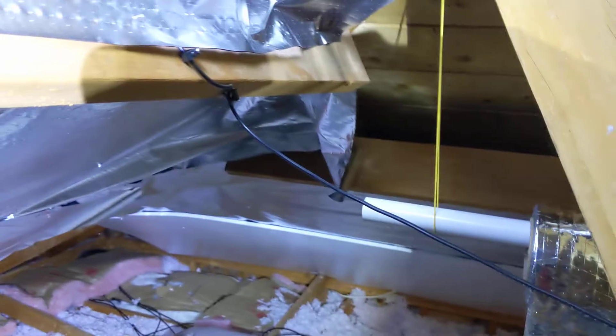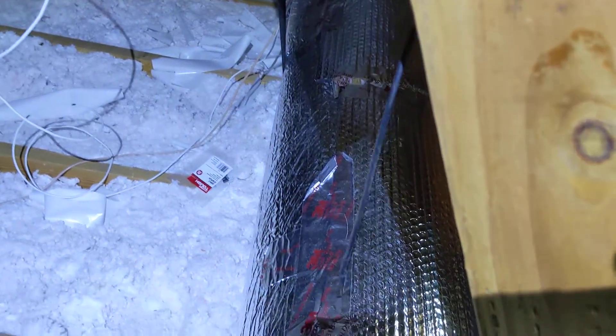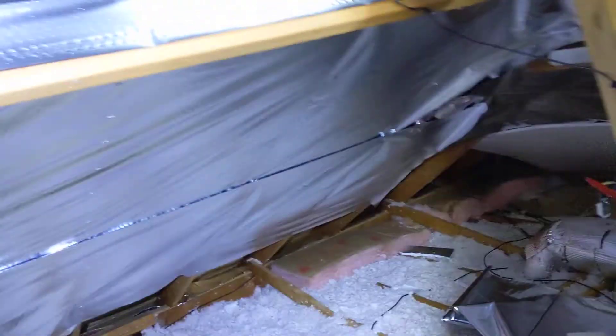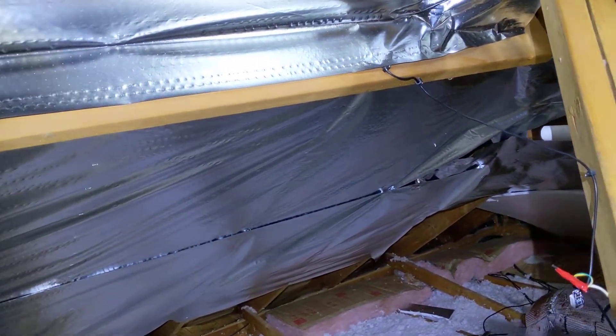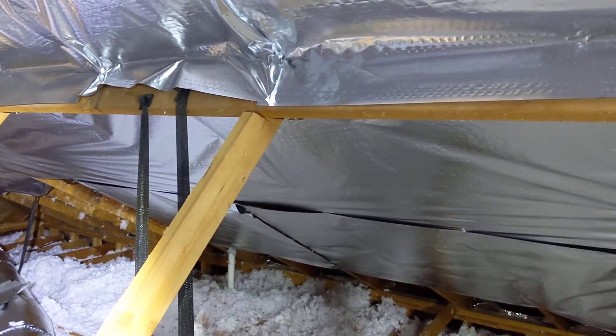I am monitoring the temperature and humidity. I have a DS18B20 and a DHT22 all coming out of the attic — one above the radiant barrier and the other below, with humidity measured right there. So far in November the inside of the attic is about 78 degrees and above the radiant barrier is about 90. Hoping that by the time we get to August peak temperatures it'll still make a dramatic difference.